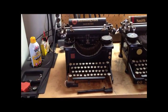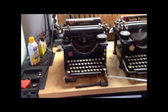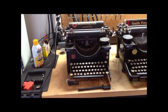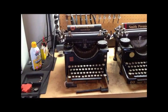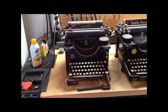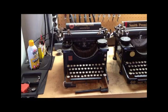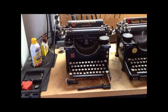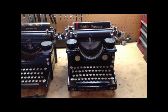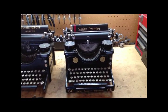The Remington Smith Premier 30. This came up today because we're going to JB Weld the frame. It's about 66 or 67 degrees outside this far north for this late in October — probably the last day we'll have like this. JB Weld doesn't like temperatures below about 50, so this is the optimal time. And here's a typewriter you've seen before on the website.